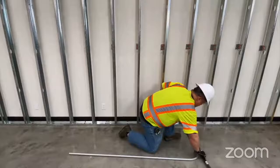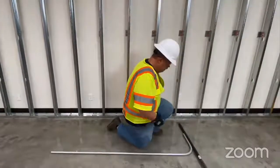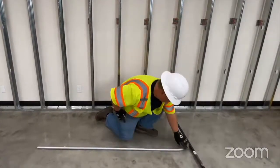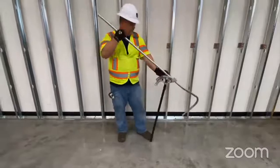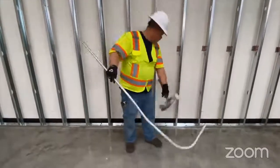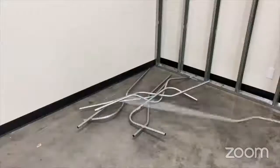Some folks have a really good eye for it. Now you're going to use the bender as a straight edge because we're going to put a set on this pipe. Measure it out, make our marks — again, hunched over on the floor. Try and get it lined up; conduit wants to move a little bit on you. You get your first kick in, now we've got to flip it over, try and stabilize it using our knees so we don't slip on the floor. Now we look at it and — darn it — another dog leg.